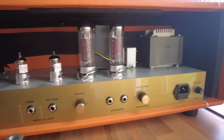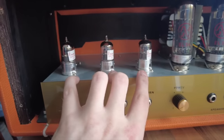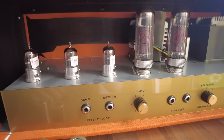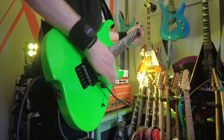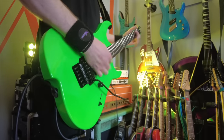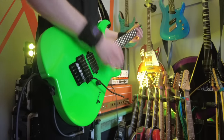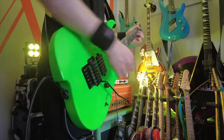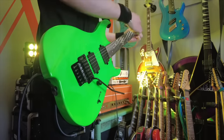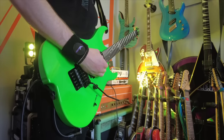I've taken the back off the amplifier and we can see more clearly what our setup is. I've taken the three shields off — a lot of gain for just three preamp tubes. These are three 12AX7s and two EL34s, all JJ branded. And here's what the amp sounds like with a tube screamer-style boost on the front of the amp.